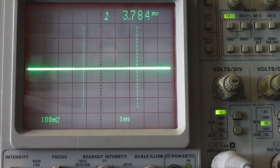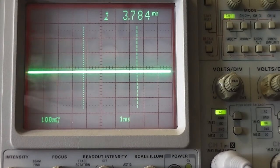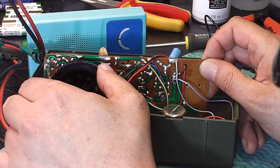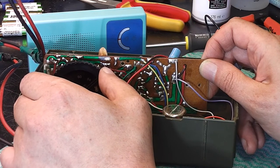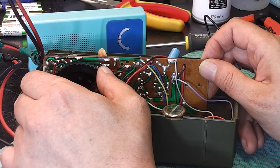I have done the finger on the pot test, and there's something there, but it seems not very sensitive. I flicked the wave change switch. Yeah, there's some sensitivity there. So maybe the local oscillator isn't working. That might be a problem. Okay. Local oscillator's working then. Okay, fair enough.